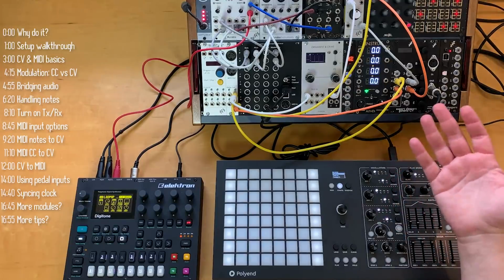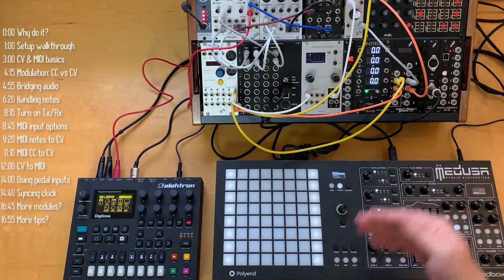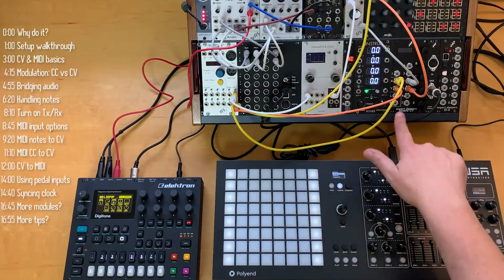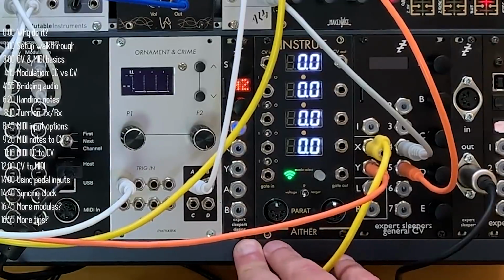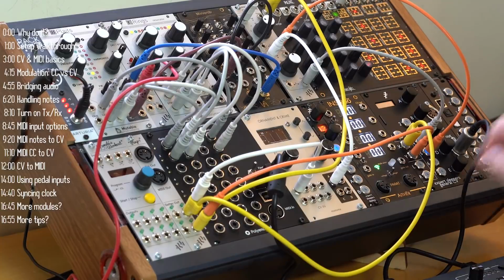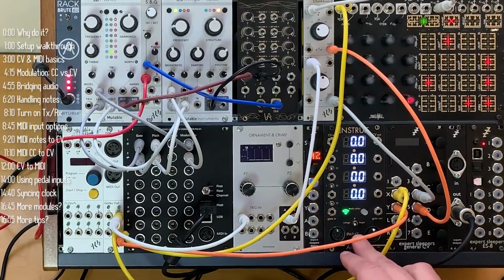Now, here it's a little bit easier to recommend specific modules because I'm not familiar with a lot of modules that do CV to MIDI. If you know of others, please leave a comment below, but the ones that I have here are either Disting, Aither, and General CV. Disting can convert CV gate and pitch into a MIDI note and either send velocity or convert CV to CC using one of these outputs. And again, you will need to attach this expansion module to it. Aither can convert 4 different voltages to 4 configurable CC channel values, and I believe they're going to add the ability to convert a pair of inputs into one MIDI note.